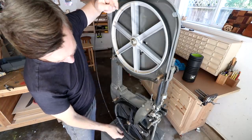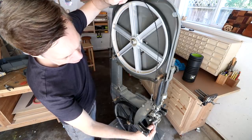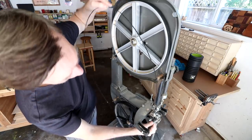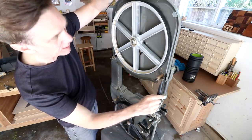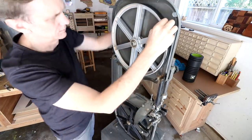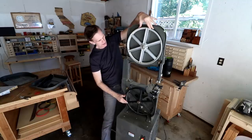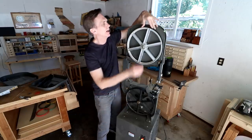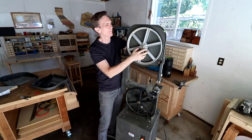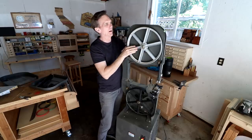This is really the trickiest part of the entire procedure — not just getting the blade onto the wheels, but getting it centered on the wheels. It just has to fit through everything; it fits behind this little guard here over the top. It goes without saying, just make sure the teeth are going in the right direction — it always cuts down. I've got it basically in place and now I can start to increase the tension on this wheel. Don't worry about the tracking knob just yet.